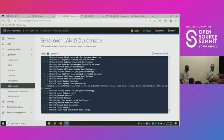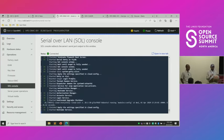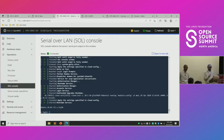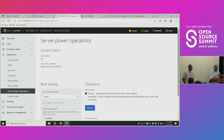That's roughly it for the demo. The main purpose of this tool is really to develop open firmware and push automation all the way to the end, avoiding having to touch any kind of hardware. There is an operating system installed — it has booted Linux. You can see an end-to-end solution. We started from scratch with no firmware, loaded OpenBMC and Linux Boot that we just recompiled, turned on the power, started the OpenBMC image, started the Linux Boot image, and booted into a regular Linux environment based on Ubuntu.